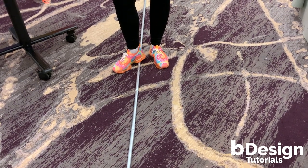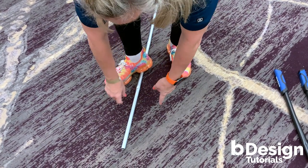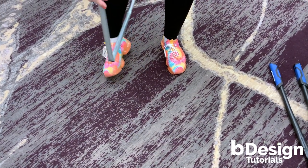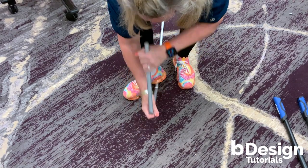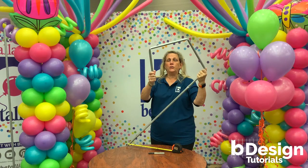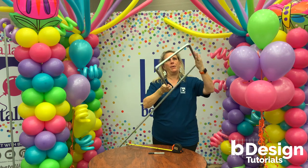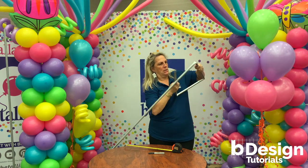Now you're ready to bend steel with your bare hands. Place your heel back at the top of the conduit, lean down — that crimp is going to give you just enough with the fulcrum of your foot to give you your first bend. Continue bending so you get the first three parts of the triangle going. Once you've weakened the metal a little bit, it's easy with your bare hands to fashion this into a triangle.